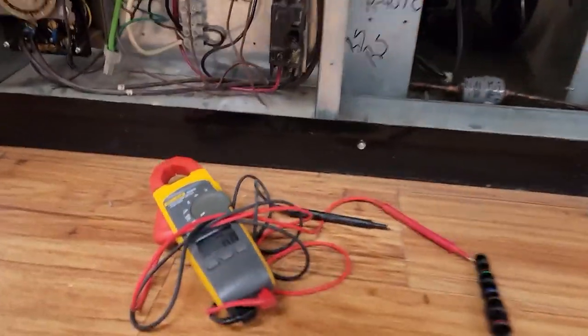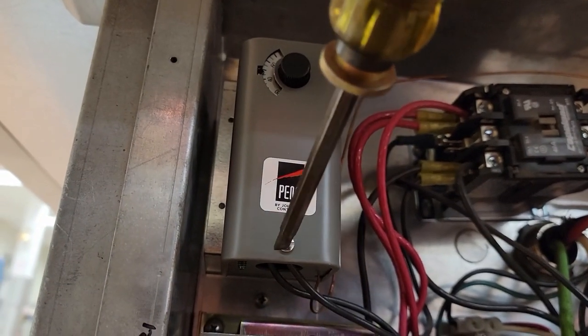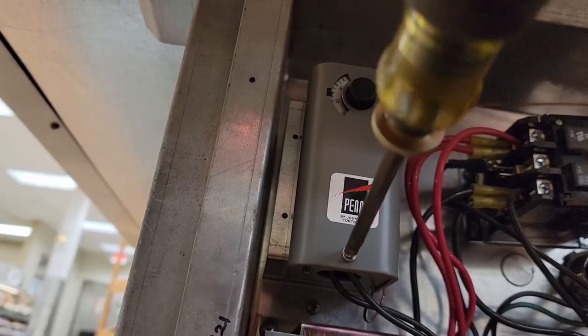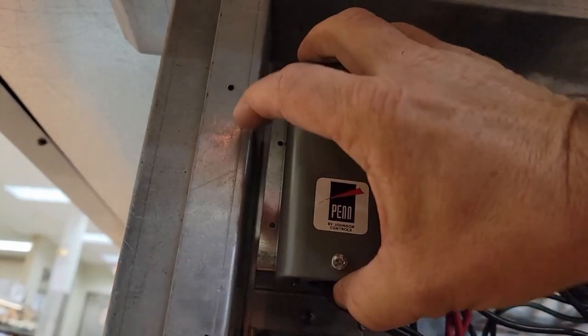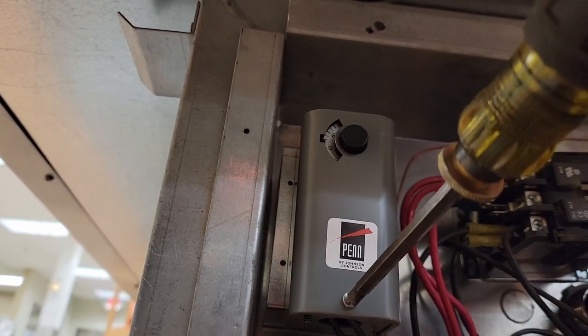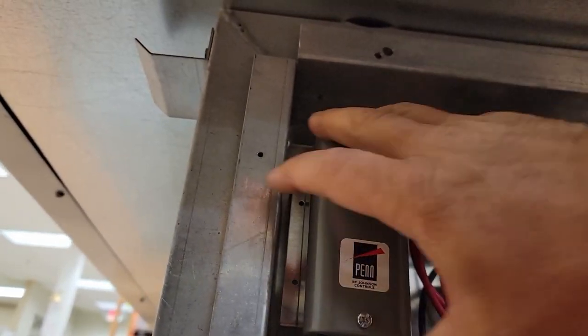We are doing that, so we'll just get that bulb out of there and get it in place. I have a feeling what happened is — because 40 degrees is really a high number — they've been trying to adjust it, it's just not been getting the work done, so they've set it higher and higher, causing issues. Nobody talks to nobody, so it was never explained to the next person. And then we've got a case that's leaking water and the store's too cold.